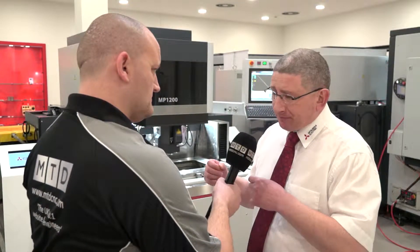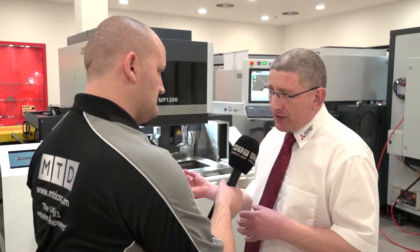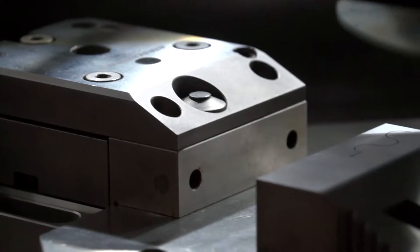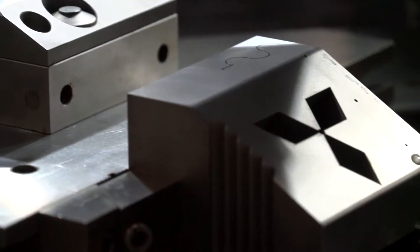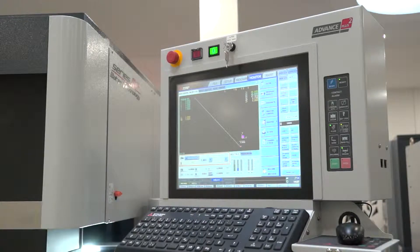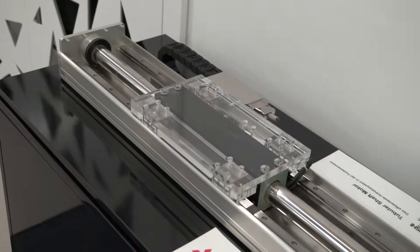The digital fine surface on the MP series has a higher frequency — it's a high-speed digital fine surface. We can increase the height of the fine surface up to maybe 100 millimeters, and we're going down to surface finishes of RA 0.1 to 0.15. We're just upping the ante with this particular machine. I hear a lot about the tubular drive technology — what is this?